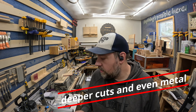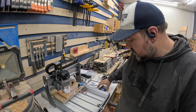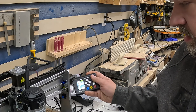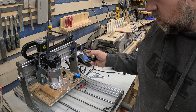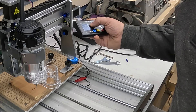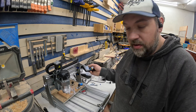I'm going to do a test piece right now. I'm using the software Easel because that's what I'm familiar with. They also have their own software that came with the machine. Another couple things I want to add: it's really cool that all the knobs let you manually adjust everything. It's also got this keypad with super nice offline controls so you can move the machine. With Easel software, you have to set where your home is, and you can get your bit lined up exactly on your piece to make sure your design is centered.